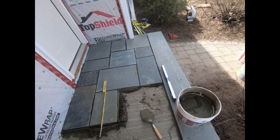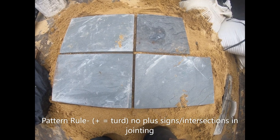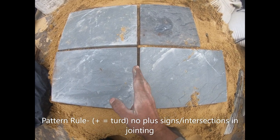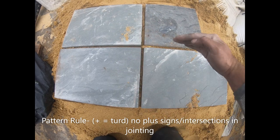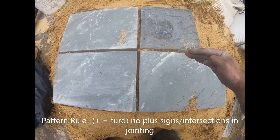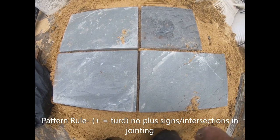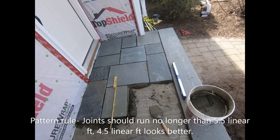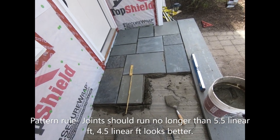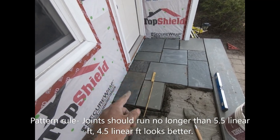Looks mad stupid. So I just put something together on the pile of sand in the back of my truck to show you another pattern rule. No plus signs. You want your patio to look like a turd? That's how to do it. No plus signs. The other rule, I like to stay no longer than 4.5 feet of a one running joint,